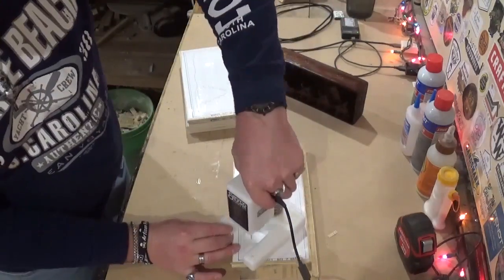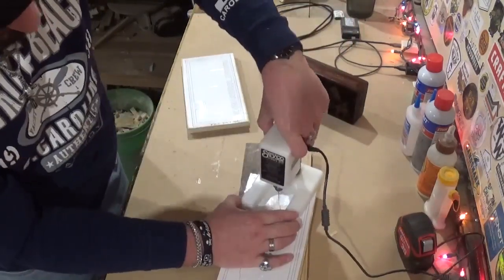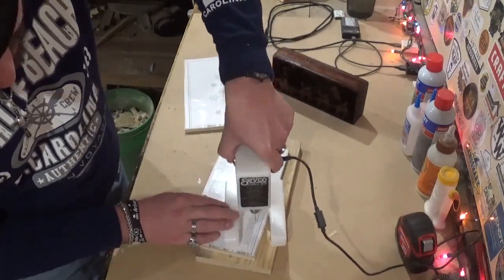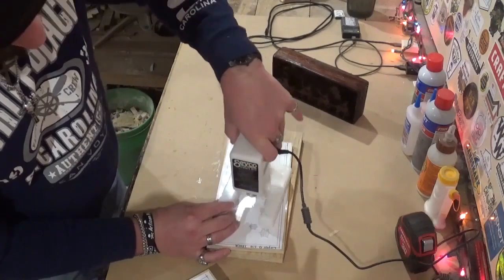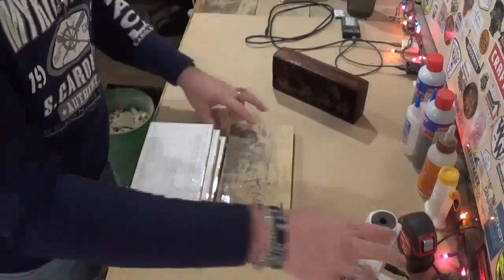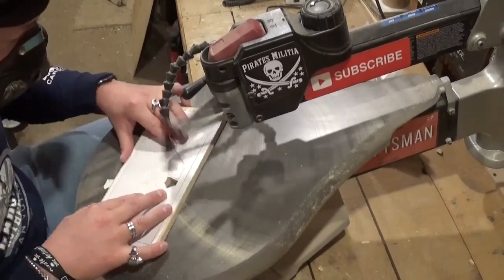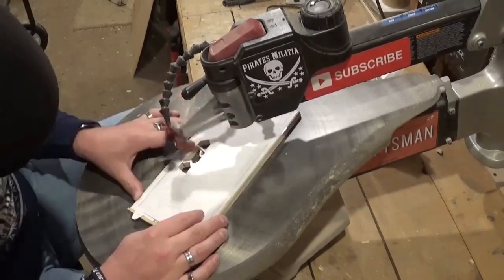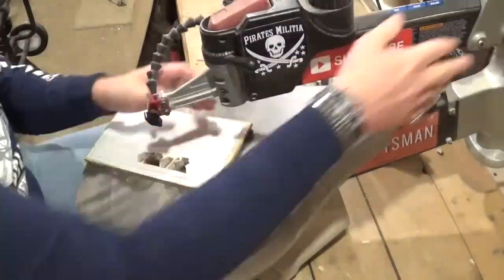Over here on the workbench I'm taking the Seyco scroller's drill and drilling out all of the pilot holes for internal cutting. All five layers have internal cuts on them. I'm using a backer board behind the scroll work to prevent blowout of the pilot holes on the reverse side, which helps us locate them when it's time to be over at the scroll saw. I'm using a number five ultra reverse tooth blade for all of the scrolling on this project.